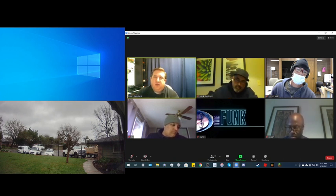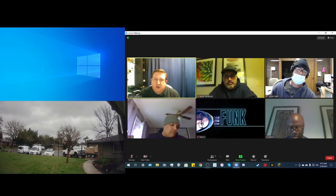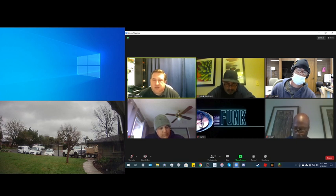Linoleum, we think of the linoleum floors that you would see in people's homes for many years. Those are becoming outdated, but we still see commercial sheet vinyl, which is a type of linoleum material that is just rolled out and glued onto the floor. You'll see it in restrooms. You may see it in medical buildings. They can get pretty decorative with those kinds of flooring. Most of the resilient flooring, the majority of it, needs a coating on it to protect it because it is a soft material.